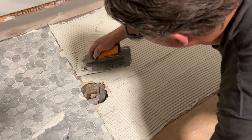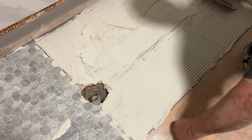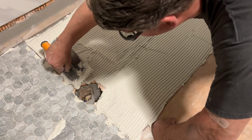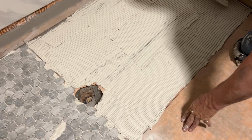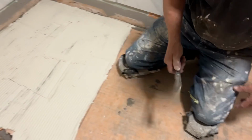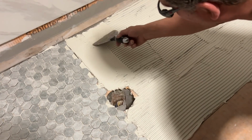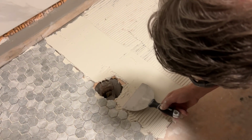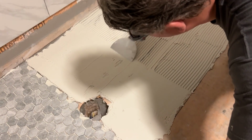Take a little time to go a little bit in there. And again, trying to hold your trowel at a 45-degree angle as much as possible. So then I'm just going to take a 6-inch broad knife or putty knife and fold. I'm just laying it on there, just dragging it on the top. I'm not really putting any pressure on it, but I'm just folding the trowel marks down on one another, because the trowel is really a gauge. And I don't want to take any of this gauged amount of thinset off, but I don't want to have a lot of ooze